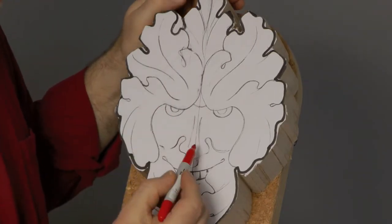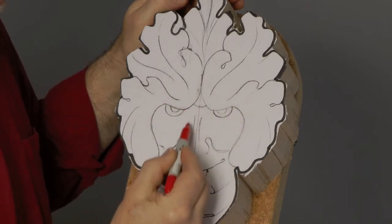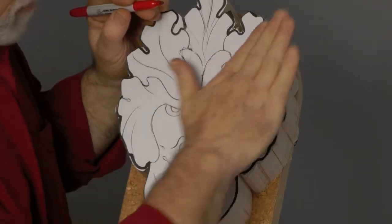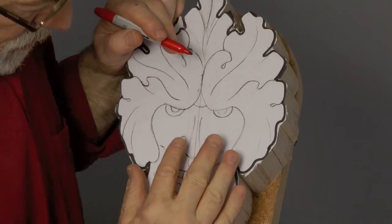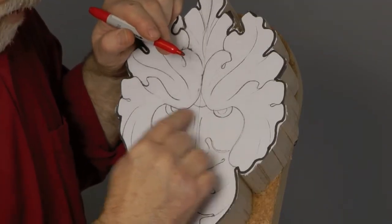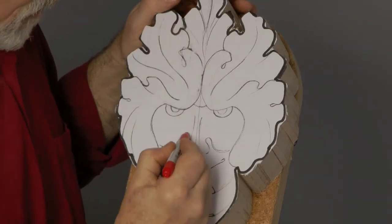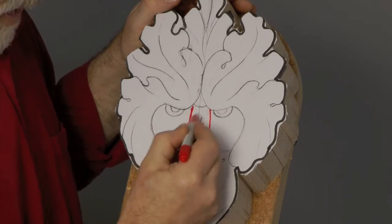The main high spots on the carving will be the forehead and the nose. From the forehead, the leaves go back and turn and keep fairly high. From the nose, this chin part all round and go lower, and of course we have eye sockets in here. So the high spots will be the nose, so this area here. We certainly don't want to take wood away from there.